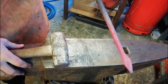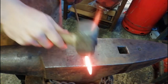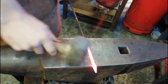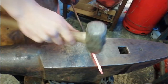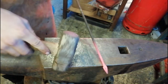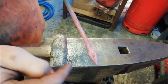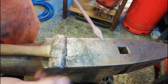Piece there. We're going to bring that down a little bit more then centre punch the eyes in, so you've got the snake's head there. Just going to bring this down a little bit more. Now we've got a relatively clear difference between the neck and the rest of the body, because it's a little bit thinner. So now you're going to get a centre punch, just because you've got this diamond shape, just around where the points are there. So you've got a nice wide part there, so it's not too cartoony, if you know what I mean.